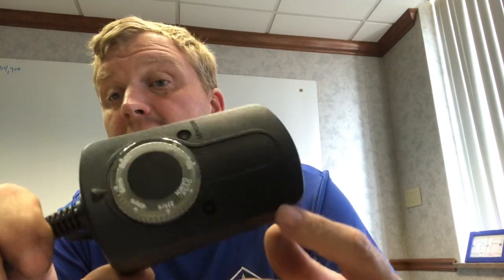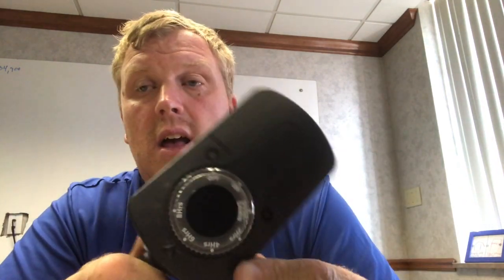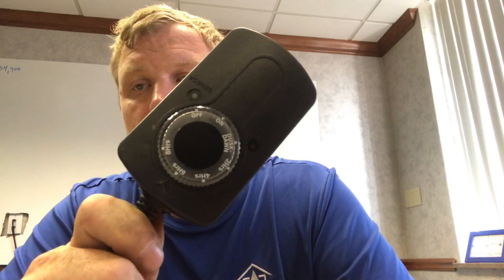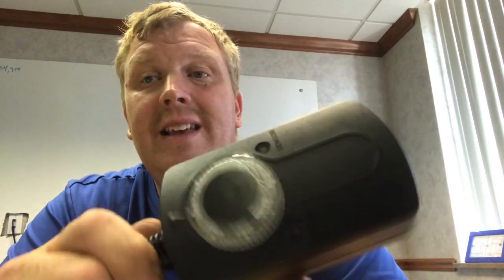Some issues customers have: they'll say their lights aren't coming on or aren't turning off. What it could be is if the sensor isn't shaded. A lot of times your plug will be in the front door foyer area as you're going in from the outside. If that's the case, the outside light won't allow this to work. So you'll want to make a short extension cord, run it, and put the timer underneath the bushes so it's out of the light.